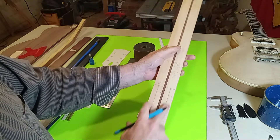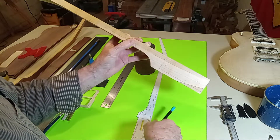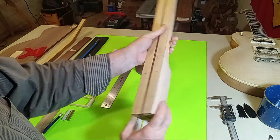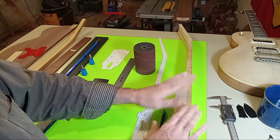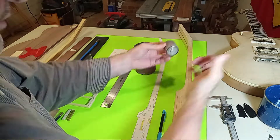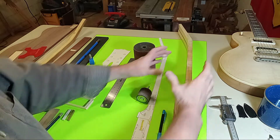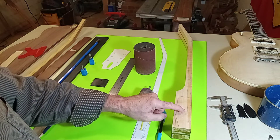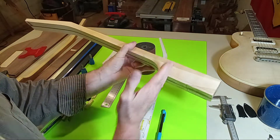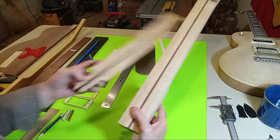Then put it on the table saw and cut the tongue or tenon. Do not remove the tenon 100% — the ten-inch blade will leave a corner up here that holds it in place, and you don't want to relieve that yet because you'll need that base for your router. When you come in with a two-inch wide router bit cutting this area, you've got to have something for the base of your router to ride on. Once that's all routed out and you're happy with your heel, you've got your taper, then you can do your finish cut work with your Japanese saw.